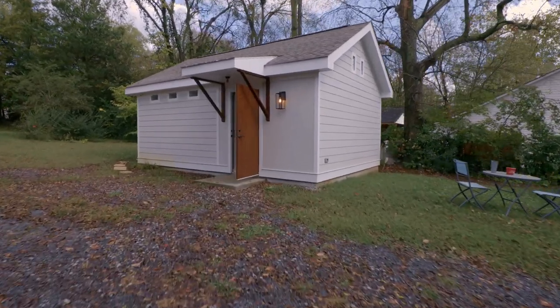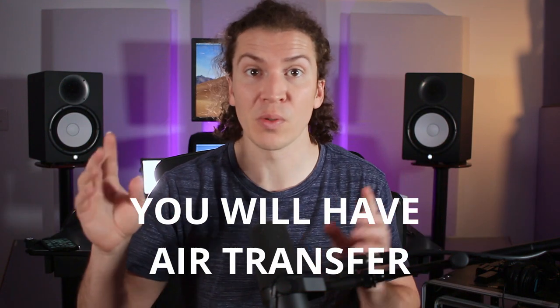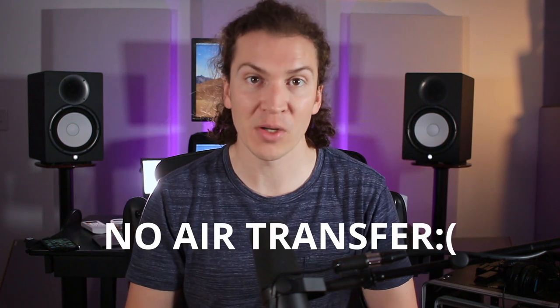Let's go backwards and think through why I didn't put in a ventilation system in the first place. I got some really bad advice from somebody I trusted, which was that since my studio is outside and there's a door directly opening to the outside, I would get plenty of fresh air every time I open the door. There is some sliver of truth to this. If the temperature in your studio and the outside are drastically different, there will be air transfer due to the law of physics — hot will move to cold. However, for many months of the year here in Nashville, those two temperatures are really close to being exactly the same. Therefore, without a fan, there is literally no air transfer in my studio.